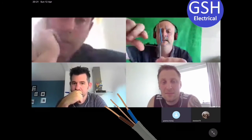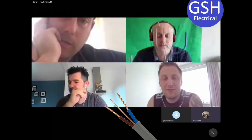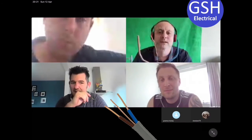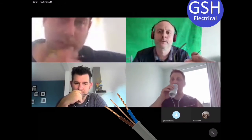Anyone remember from the classroom, the workshop, why the CPC isn't in these styles of cables covered in any PVC? Because it only carries current under fault conditions. Fault conditions to where? Earth. Good. And Nick, Dan even. So I nearly got you, Dan. Dan, what's the maximum time the CPC will carry current for us? Maximum time. 0.5. Okay. And Tim, maximum time? 5 seconds. And let's go for John, maximum time?